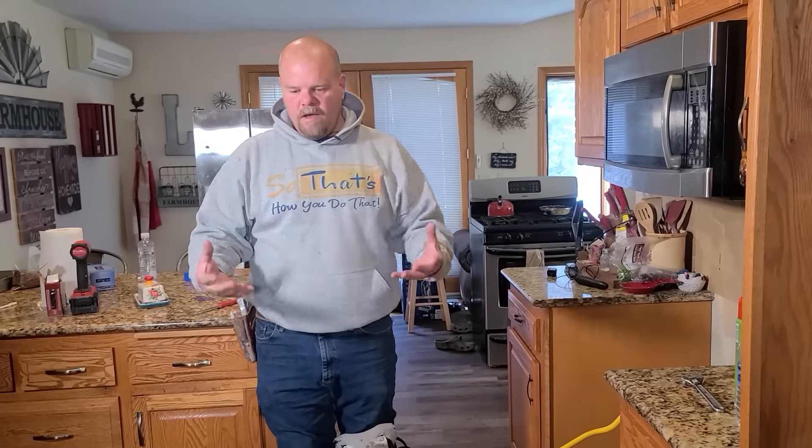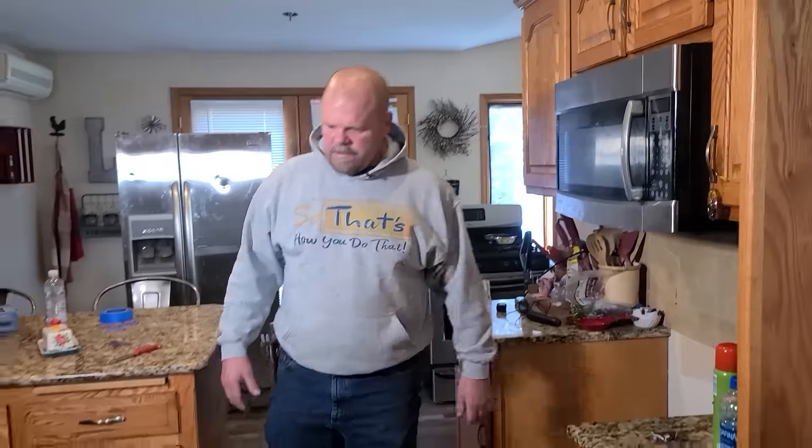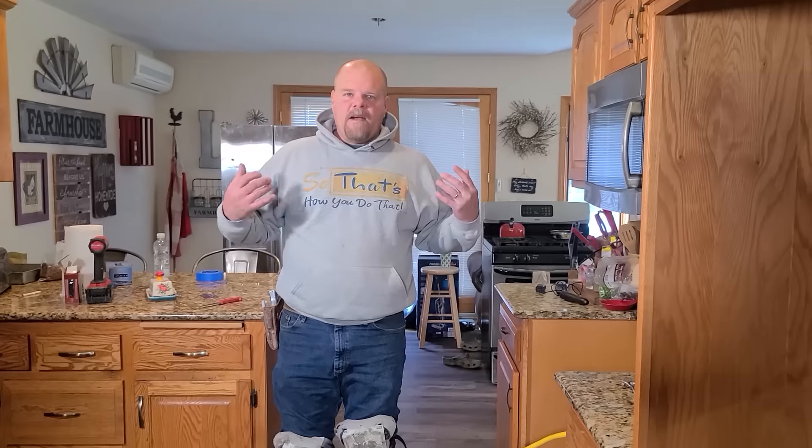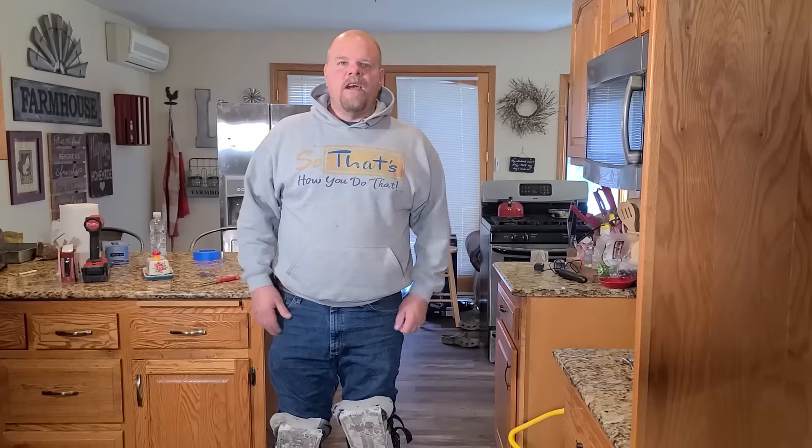So I made a big mistake here — I installed this plank over a wood floor, tried to staple it to save the floor for future refinishing, and it didn't work. So now what we need to do is pull up this vinyl plank. We're going to pull this plank back up and screw this floor so that it's nice and solid.